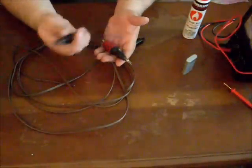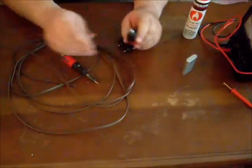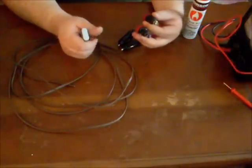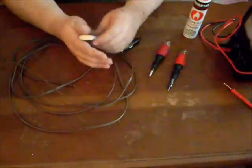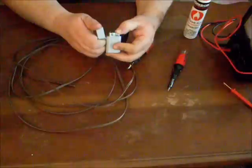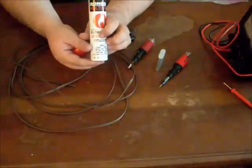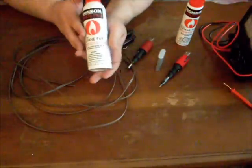The other things I am going to be using today is a butane soldering iron — an electric soldering iron would work fine too. I am probably going to be using the butane torch for the bottom connection so I can get a lot of heat on there. If you don't have a butane torch, you can buy this at Radio Shack for like $29 — it comes with both tips. I keep two of them because I lost one once. If you don't have a torch you can go to Walmart and buy one of these little guys in the checkout lane for $3.97 — it's a little mini butane torch that fills up on the back and you can adjust the flame height. Also a can of butane — you are going to need to refill. You can buy this at Walmart or buy a big can for just a little bit more at Walgreens.